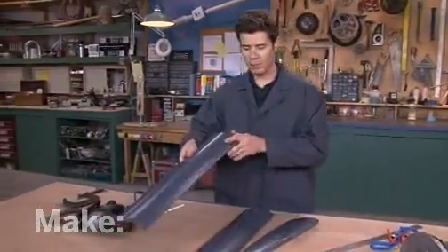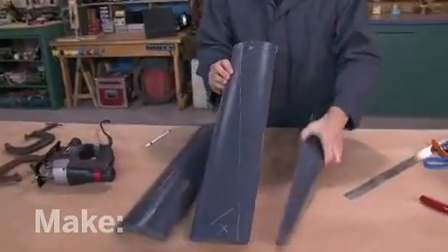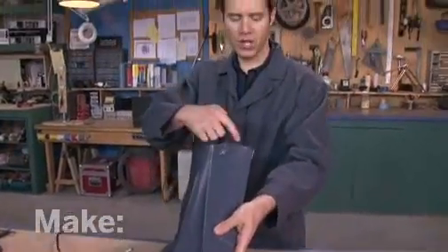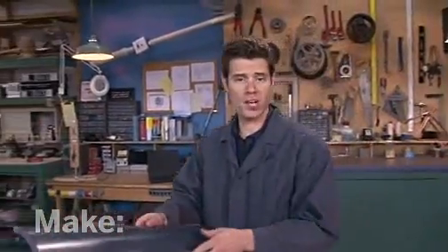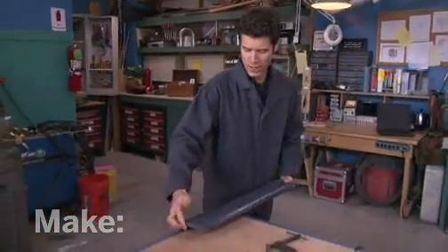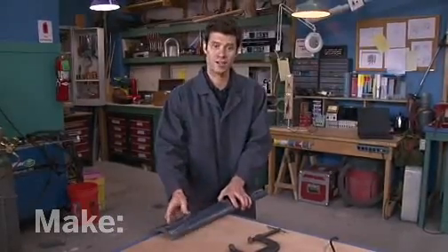I've finished cutting out my blanks, and I'm actually going to be able to get two blades out of each of these — you can see where I've marked it up. I'm also going to remove a little notch to reduce the amount of turbulence between blades. You could cut this on a band saw using a jig; I'm actually going to use my saber saw, clamp it to the table, do half the cut, and then flip it around and do the other half.